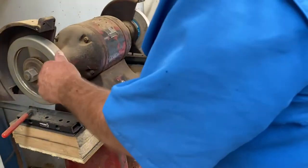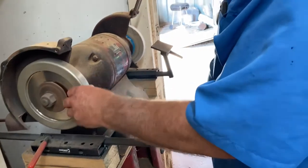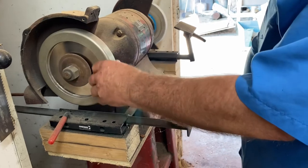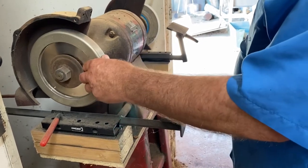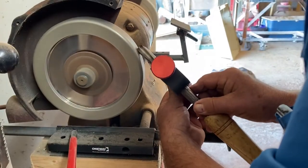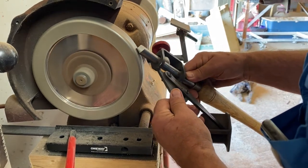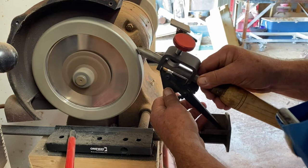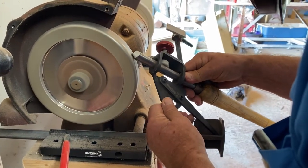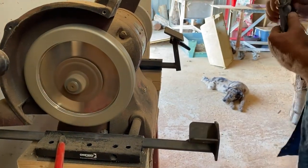I got a 180 grit CBN wheel, which is mid-range from what I've seen, and I saw on YouTube they said if you're going to buy one grit, buy the 180. That's what I bought, and I think it's all you need. It doesn't take much off. You have to get used to it. Say if there's a better sharpening system, I don't know what it is. It's probably some just as good. Just if you don't know what to buy, buy this. Follow the setup. Good instructions. They don't pay me anything to say this, but can't do better.